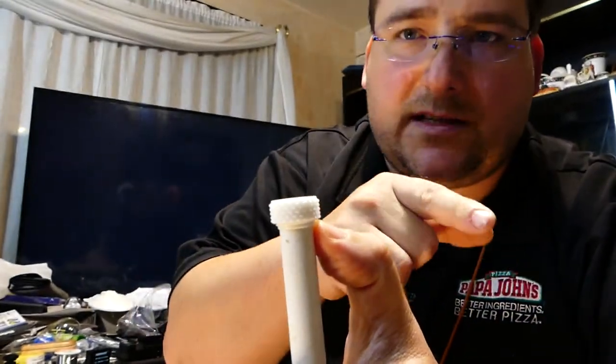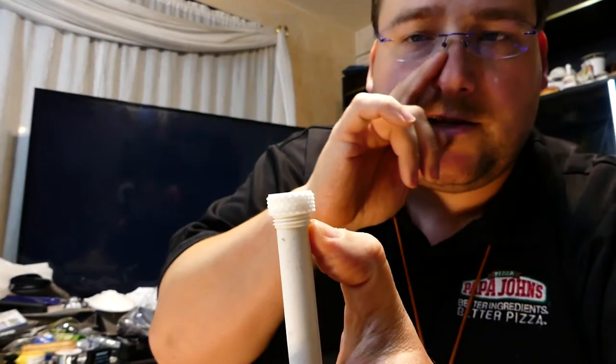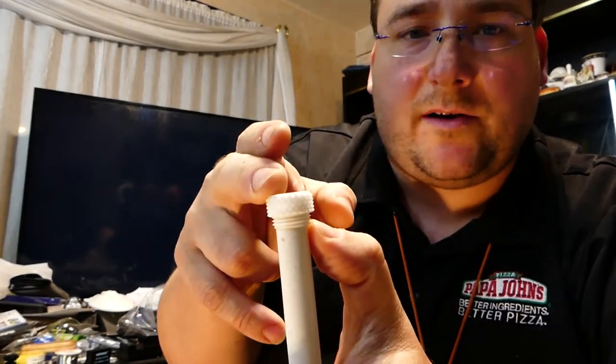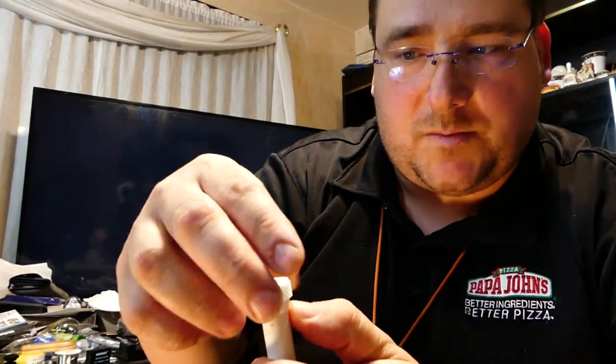And by the way, that's no cleanup. That's how it comes off the printer. That's how good this Ender 2 is. These are printed at 100 microns because they're a little dirty at 200 mics. The 24 and 29 I print at 200 mics, but the 13 and 18 millimeter I print at, I don't even know if that's printing. Yes, it is. I never checked. But these print better at 100 mics. They're much, much better.